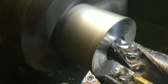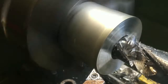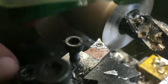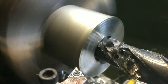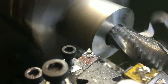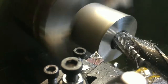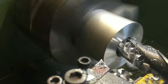I can speed things up, give it another spray. In now — I'll give it a spray of WD-40. I was running about 350, maybe 450 RPM. Great stuff — scattering well. As I said, it's aluminium, it's going to go through easily. The part is 40mm thick, so once I get to about 20mm I'll wind it out, give it another spray, and just let it work the rest of the way through.